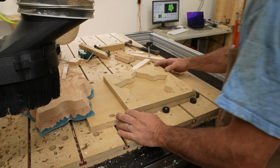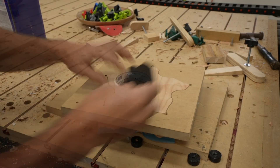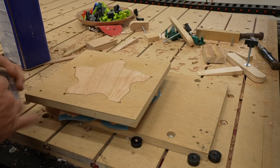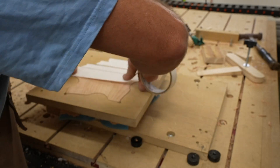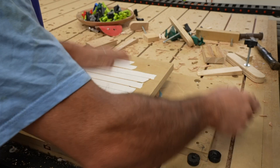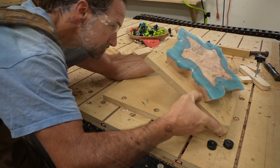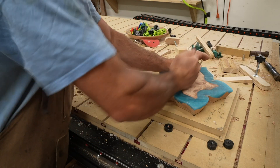The top and inside. If I machined the jig correctly, the spoil board holes should line up perfectly with the holes in the jig, and the bowl should fit perfectly in the cutout. I can then flip the bowl over — the jig sits just a little bit lower than the bottom of the bowl, so the bowl is the part actually taped down to the CNC table. I wipe it off with acetone and also wipe down the spoil board to remove dust. I put down a bunch of tape and also tape past the bottom of the bowl into the jig a little bit to hold it all together at the right location. I put quarter-inch wood dowels into the alignment holes, remove the backing on the tape, align the dowels into the spoil board alignment holes, and squish it down really tight.